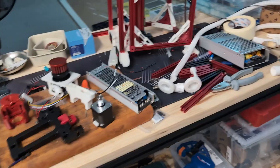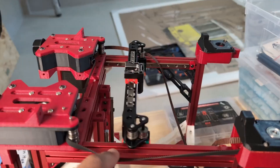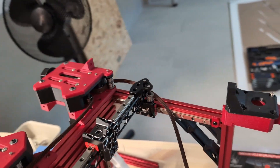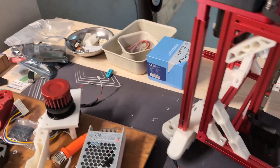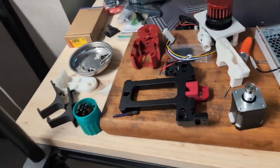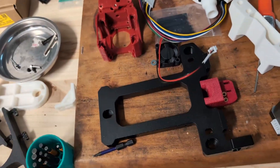That's basically the progress update for now. I'll get back to you when I'm able to flip the bearings on this side and get the gantry mounted for a final time, and hopefully when I've finished designing the tool head. For now, I'm going to print some little spacers that go in here to stop the springs from sliding around — the same mod I have on my other V0 — because it helps the bed stay in the correct spot more easily.